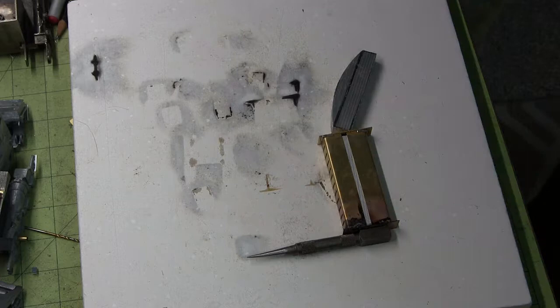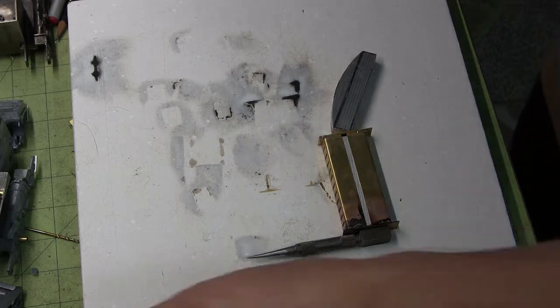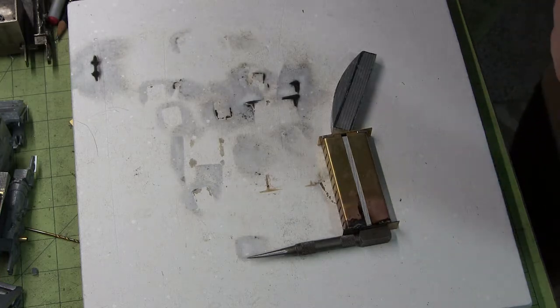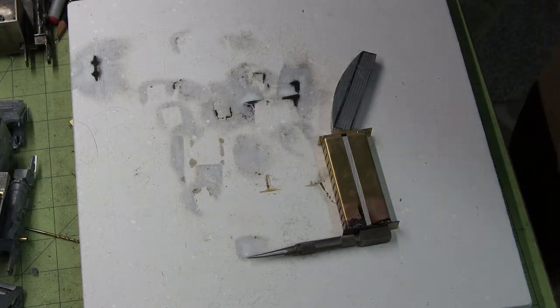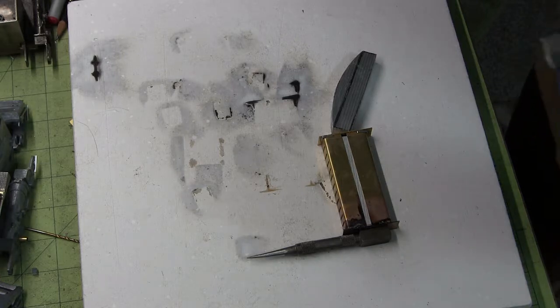Alright, I'm going to try this again. This time I used smaller pieces of this solder. I can't... Excuse me, cat. I don't care. Don't listen to her. She's lying. I used a little bit smaller pieces of this. I can't remember what the compound of this solder is, but I do believe it's got a higher zinc content to it, and requires higher heat. So by using the big amounts that I did on the other side, I think I kind of screwed myself. It did still connect, it just left these nasty gobs because I wasn't able to completely thin the material out.